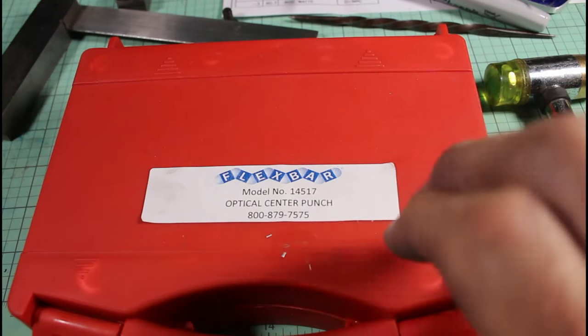Well, I was going to use a parting tool to start the V, but then I realized I have a cutter that has a 15 degree angle on it, and I have the reverse of that, so I'm just going to do that with these carbide cutters. I think that'll work just fine. So basically I just need to go 0.186 deep with this cutter. Let's see how that plays out.